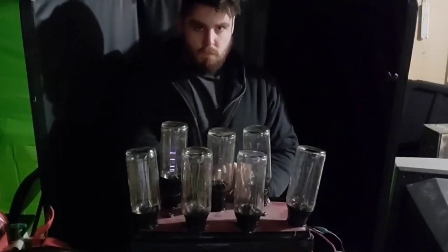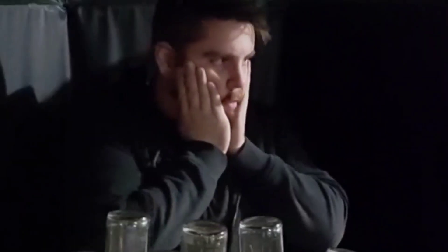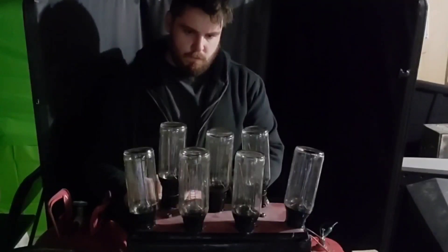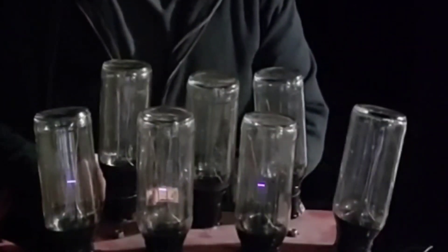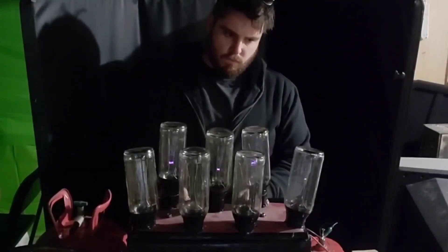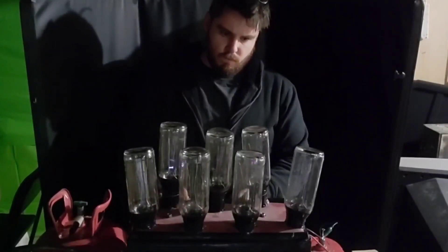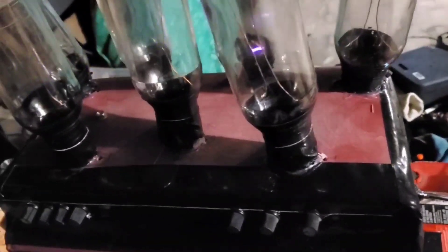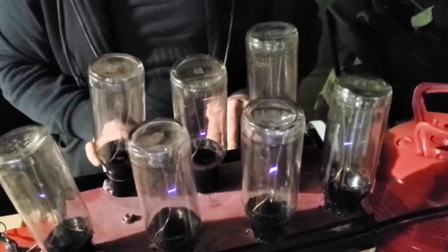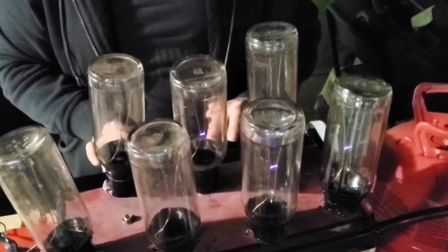It was a little quiet at first because I'd sealed the bottles almost completely to prevent helium from escaping. I went back in with my soldering iron and poked little holes in the sides near the high voltage leads to let the pulses escape — a little bit louder. I think I'll need to cut some holes in the bottles and put a little piece of paper over them like a speaker membrane so the noise travels better without losing too much helium.